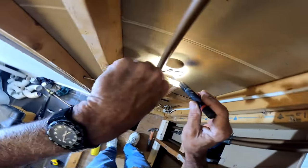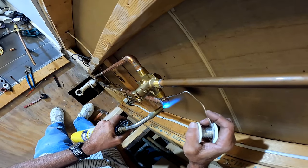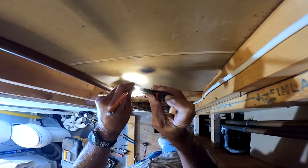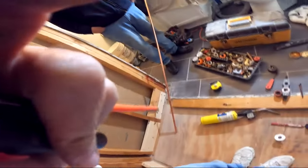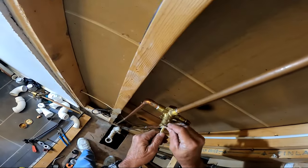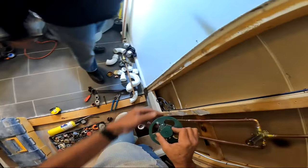I've got a flashlight and a mirror because I always want to check all my connections. I noticed on one 90 to the right there was a hole showing, so I had to re-sand and re-sweat. By the time I get to the brass valve proper, it's preheated, which makes life easier since brass is harder to heat than copper. When I turned the water on I had no leaks — 99.9% of the time I never do — but it would have been a pain in a condo, potentially shutting down six to eight units.